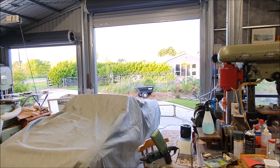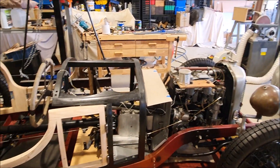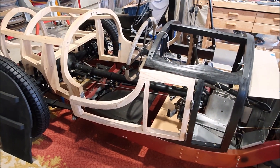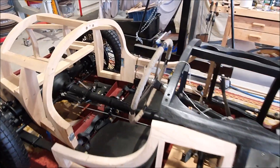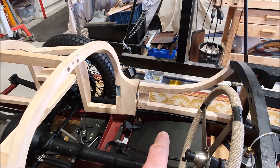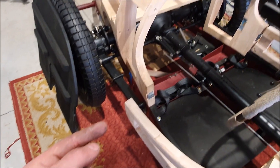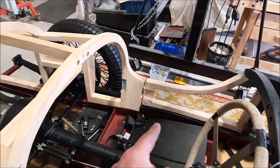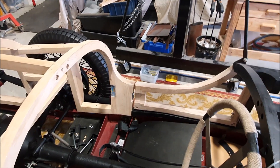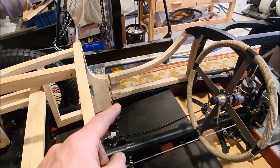It was another really nice day and after work I came straight out to the shed. I'm going to be away tomorrow night and probably won't get much done the night after when I get back home. I wanted to progress this. I fixed the passenger door with a new piece of timber set in. I've realized that my screws that go through to hold the metal strips actually go into that space, so I may have to get shorter screws — but there's still plenty of timber there, about an inch thick.